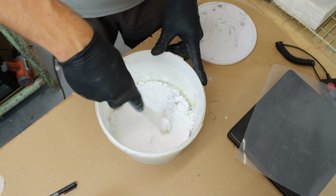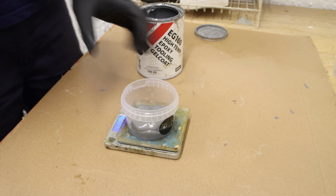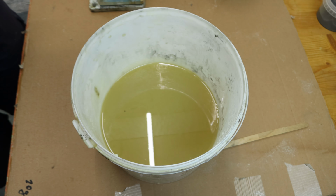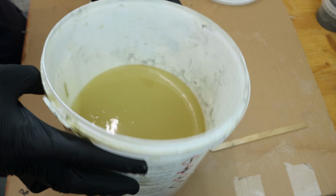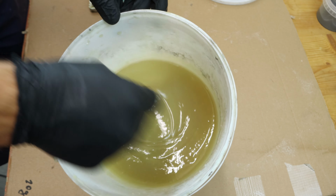Begin the mold making with the high temperature gel coat. First, I measure the gel coat into smaller quantities. This way I can control the hardening time a lot more efficiently. I measure 4 times 100 gram gel coat into the cups. This will give me 2 coats over the pattern. Also measure the laminating resin ready to go, as I will be starting laying the glass mat straight after the 2 coats of gel coat.